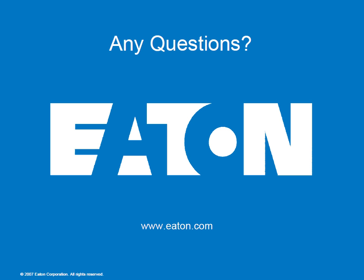Can you just talk about the switch gear for a few things? We didn't talk about switch gear, which is coming, just maybe 2 minutes. I know it's old. Sure. Switchboard and switch gear. Everything we've been talking about now is switchboard. Switch gear is a different standard. So it's a different UL standard, different construction standard.